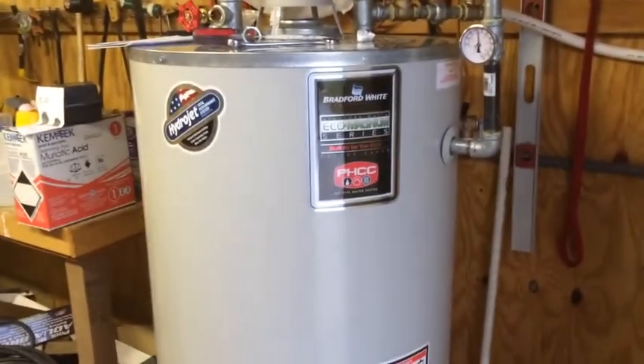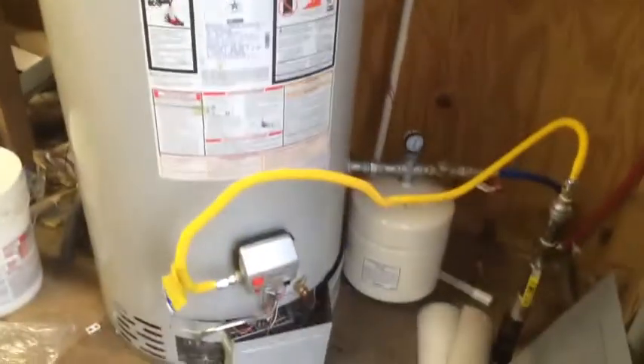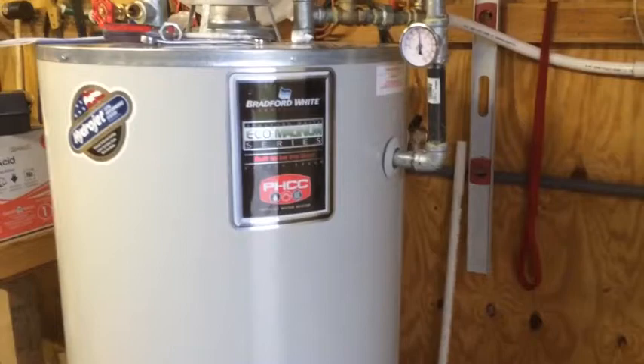If I go over here inside the barn, you can see the heart of the operation. This is a big old Bradford and White 75-gallon, 76,000 BTU per hour heater that has these two side bungs on it that are made for radiant heating for floors.